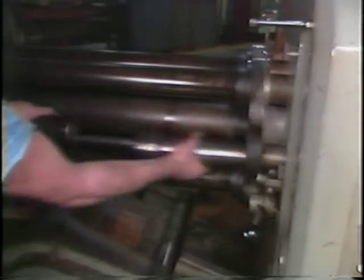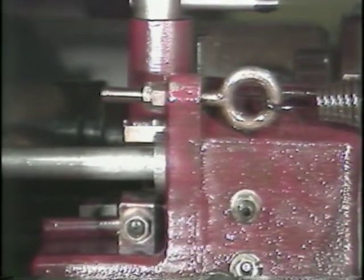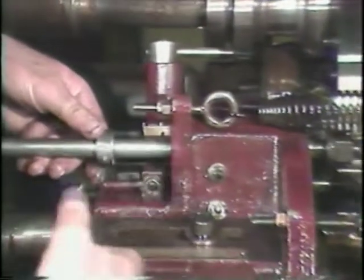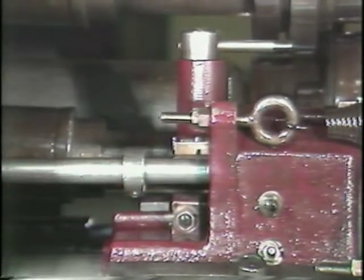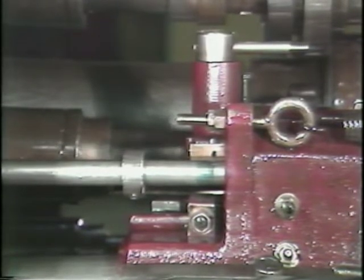To adjust the out of stock mechanism, insert the feed tube into position 6 with the stock removed, and loosen the trip rod actuating collar with the set screw. With the stock feed slide all the way back, slide the trip rod actuating collar forward until it touches the back of the stock feed return shoe. Hand crank the machine so the stock feed slide is forward, then push the trip rod actuating collar forward about one-eighth inch and lock down the collar by tightening the set screw. With the mechanism properly adjusted, the switch will engage when stock is no longer in the feed fingers of positions 5 and 6.